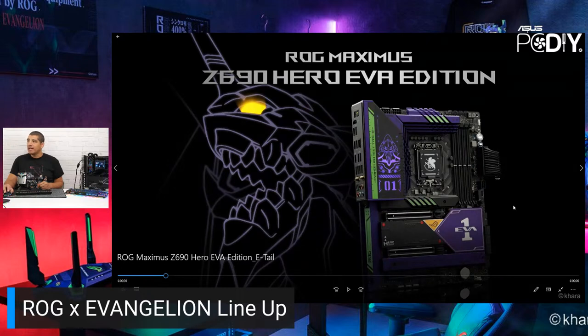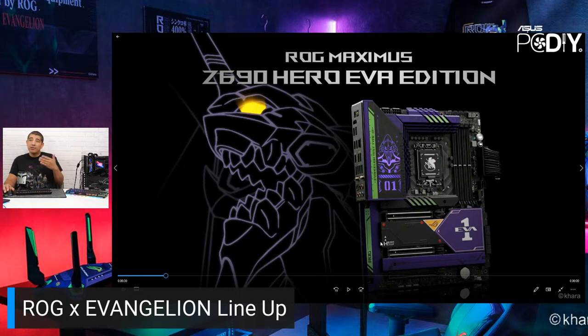That fully integrated IO shield also looks really great on the board. There are also some really cool specialized features and functions built into the UEFI, and included in the specialized hardware design. There's cool things like what we call a differential Vdd sense monitoring design, which is a much more advanced and accurate way to monitor and detect the actual voltage for the CPU.